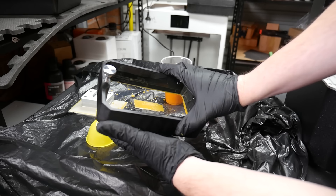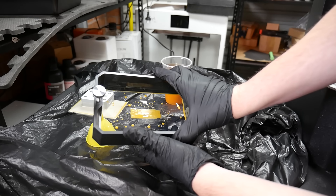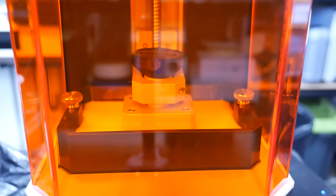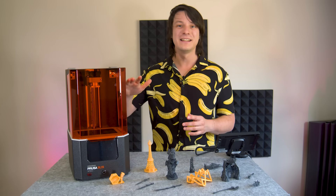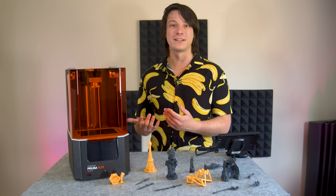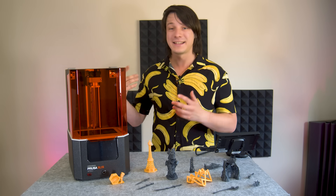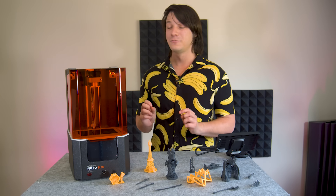When failures do happen, you need to drain the resin vat completely, and then carefully press from the bottom of the vat on the film to try and break that stuck cured print free. It's a tedious but necessary skill. Once I fixed that, I was back up and running. For security, I've since started preheating the print bed just a little bit on an FDM printer's heated bed, and I also wipe it with a little bit of resin before starting each print after going through the washing and curing cycle, and since then I haven't had any adhesion problems.